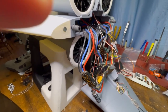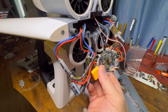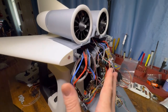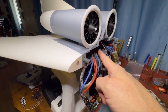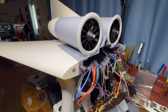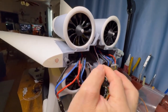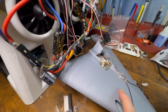That will give me more room to push these down inside without taking up so much room with wiring and putting any stress on these capacitors. From that point, I'm going to possibly extend the power wires from here to the PDB, because I need to be able to move stuff around. The battery will go way down in there — it can go a good three inches in, which gives me the ability to shove some foam down in there to adjust CG and get the battery where I need it, then lock everything into place. The transitioning system works well.